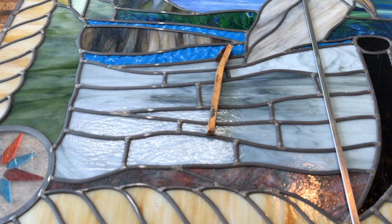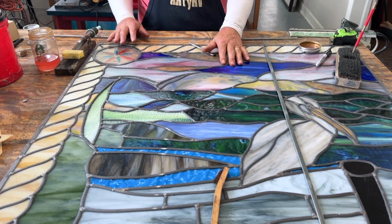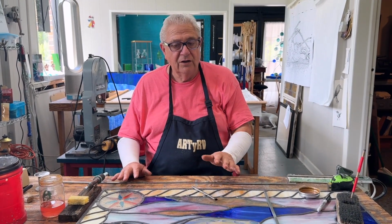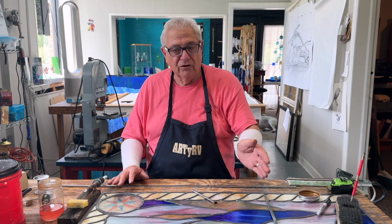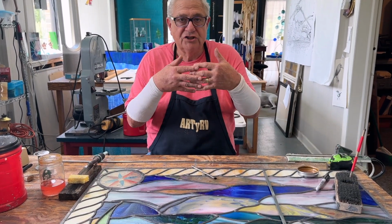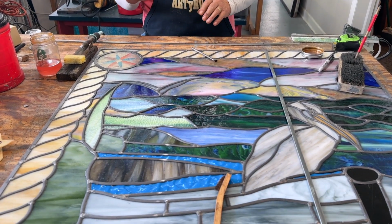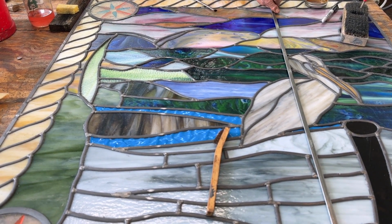Now, these windows are 11.5 feet long, so this is why we're using a vertical bar all the way across. The center section, which is 65 inches long, will have 4 rebars running vertical. And then we have how they're joined together with our H channel, which would be at another 12 inches. So everything structurally should work out. And we're gonna just show you how we apply the rebars to these windows here.